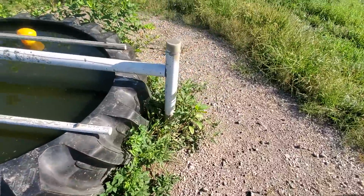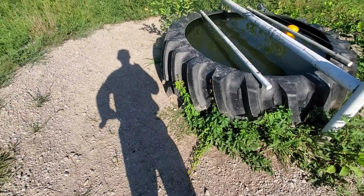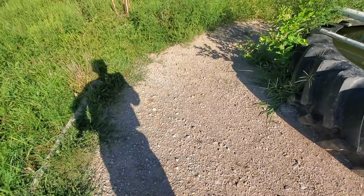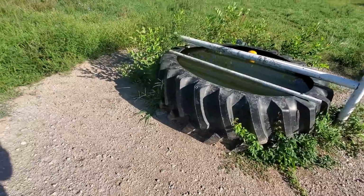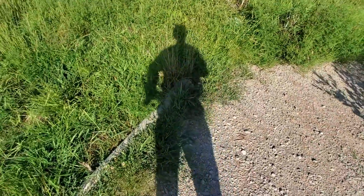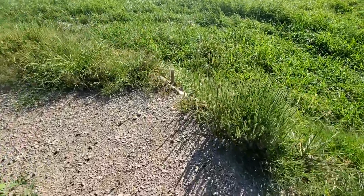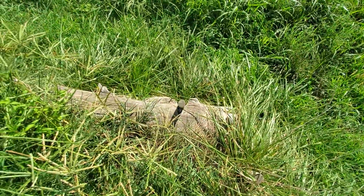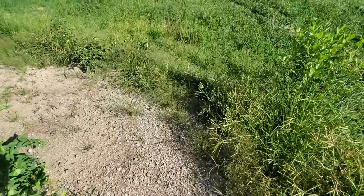So that's an 800-gallon tank. About half of that tire is actually down below the geotextile and rock. I put one load of rock in here in 2003. Yep, 2003. It's been 17, 18 years ago. And it's still here. We've never added another layer. But the reason it's still here is we put these cedar trees and we pinned them with fiberglass rods. If you don't put that around your rock, it's gone. It'll be gone in 1 year. Now you're hauling another $500 load of rock.